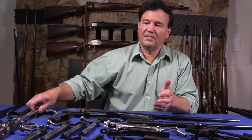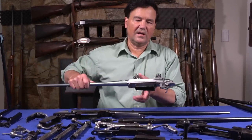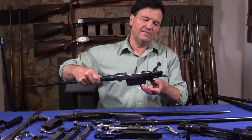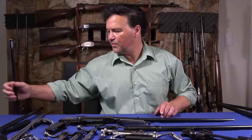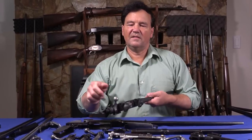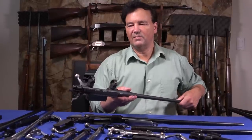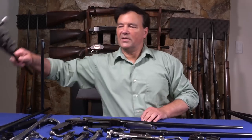The next segment: this is the Ruger Model 77 Mark II - you can see what the recoil lug looks like, and you can see the heritage to the Mauser, as opposed to the pre-64 Model 70. Here's an original Model 77 with the tang safety - they all have the integral dovetail system. The last one is the Hawkeye - the most recent, and this is the left-hand model. You can see they've gone back to the Mauser 98 system. Ruger has an advantage in building rifles because they're masters at investment casting, so they can include complex shapes that don't need machining.